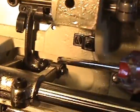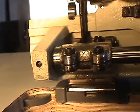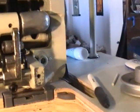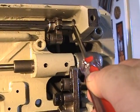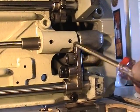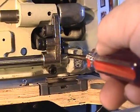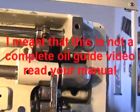The adjustments seem to be about right — I'm not saying don't adjust that, just two or three turns off of squeezing it. Your instructions tell you some of that too. These little spots here that this shaft works on are oiled from those little red dots. It wouldn't hurt to put a little oil there even if they are oiled from above. Some of these bushings here are oiled from above, but I'd put a drop on the side of that shaft right there. This little wiggler here wouldn't hurt to have it oiled right up here, dripping down on it.